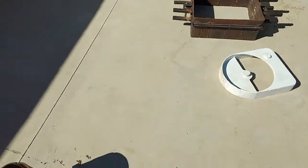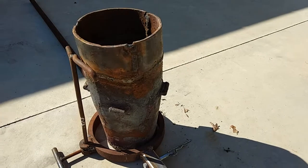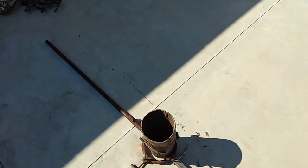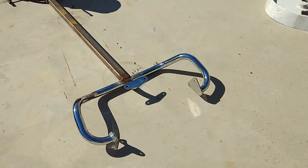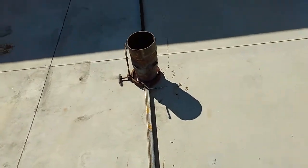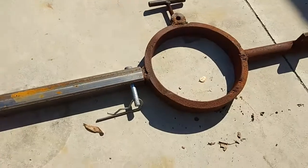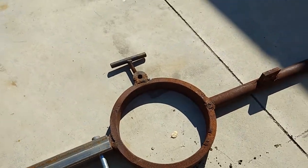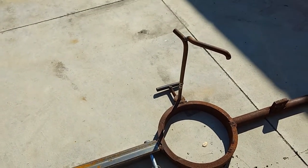In order to cast this turntable I needed more metal, so I extended the crucible up a good three inches. I also modified the pouring shank so two people can use it, because that thing is honestly way too heavy for my arms. I blinged it out with some chrome handles — I have no idea what those are from but it was the perfect use for them. The second half is detachable with a hitch pin, and the crucible is held in with this rod type thing. It's a lot better than the one I had before.